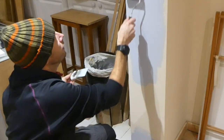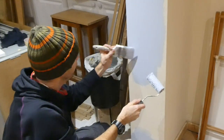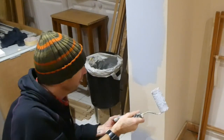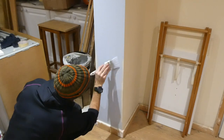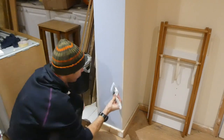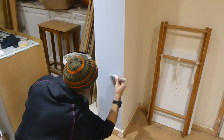Don't forget to go over it with the roller again, otherwise you're going to end up with lots of brush marks. Here's where you've got to get as close as you can to the edge without actually going over it — as soon as that roller hits the edge you will get paint on the other part of the wall. If you want to get the paint even closer to the edge you could always use the brush almost as if you're cutting in to the ceiling or the floor or the skirting line, and that allows you to get it a bit closer to the edge than if you're using a roller.